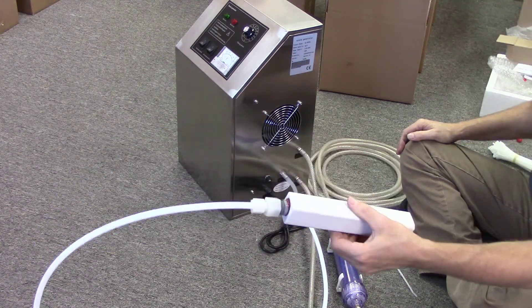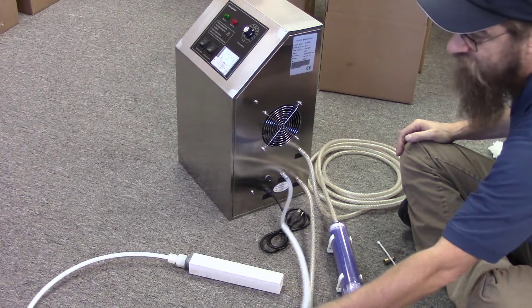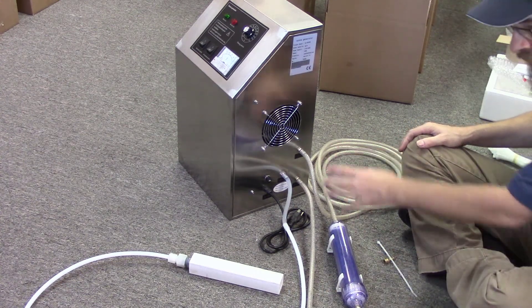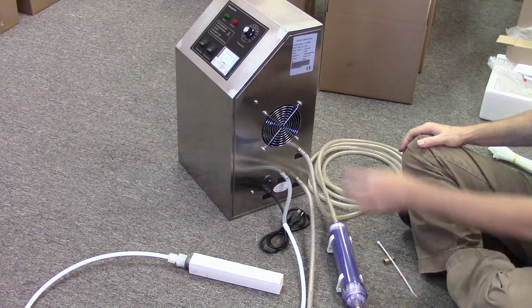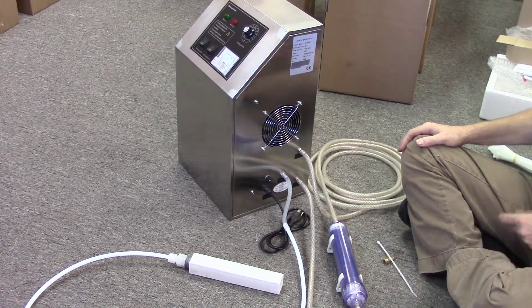Remember the last thing: this is low pressure. You can't hang this thing 20 feet down into the tank — it can only go three or four feet down into the tank and diffuse from there, because that's all the compressor motor can push. The further you would drop it down, the greater the pressure until it would overcome the compressor's ability to push air out. Thanks, folks.